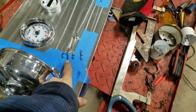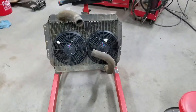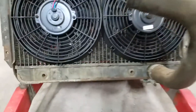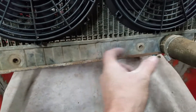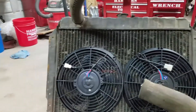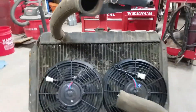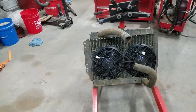For the coolant in, out, and off, if I get two 12-volt pumps — which are very common, especially in boats as bilge pumps — and get this radiator mounted on the framework, I'm thinking about getting two round tanks on each side and plumbing it all up to where I have a pipe with a T with a port coming out here that attaches to a pump. So I can pump the coolant out of the motor and the radiator over to one of those side tanks, or both. This is going to save me from having to get buckets and spill the stuff everywhere.